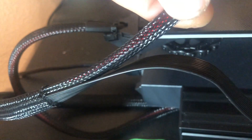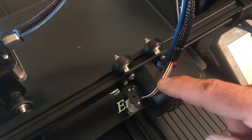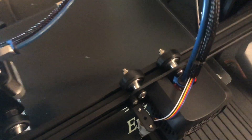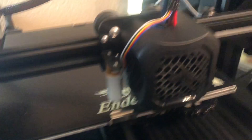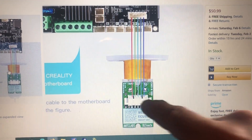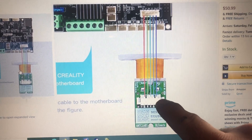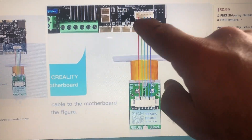To keep things tidy, I ran my cable inside the wire loom — you just push it in and it expands. I cut off a zip tie, ran the cable out, and put three zip ties back on. When you plug the small end into the BL Touch, make sure you plug it in the correct way — your paper instructions and lots of places online have the diagram. If you try to force the cable you can bend the pins, so follow your instructions matching the right color wires.